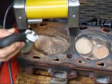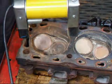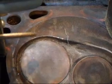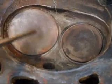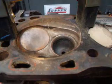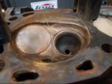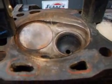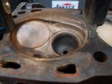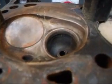As you can see, there is a crack in the cylinder head. I've removed the exhaust valve and continued my testing for the crack, and as you can see, it actually goes down beneath the valve seat and down into the port.